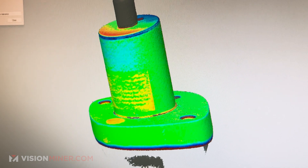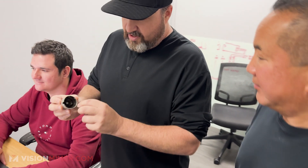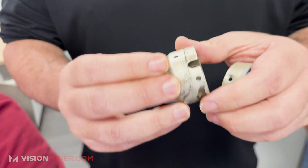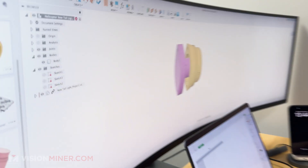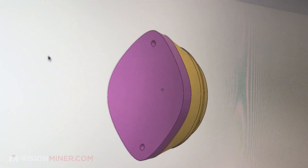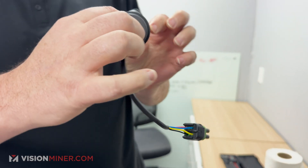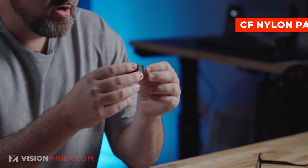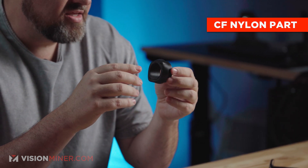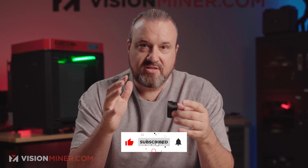Once we had that done, we took it into the CAD drawing to make the final part. I gave Jeffrey the reveal: we scanned his tail light because I wasn't sure if those holes were clocked at exactly 60 degrees — scanning gave us perfect data. Nazar scanned the new light, got the new light shape perfect, then designed the adapter part. The fit was spot on. We then went to a CF nylon prototype first to do a true fit check, screwing it into the helicopter to confirm everything works before committing to the final material.